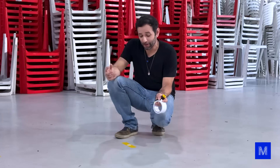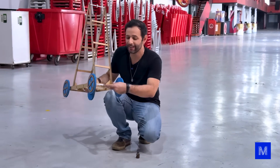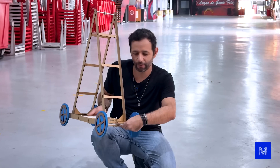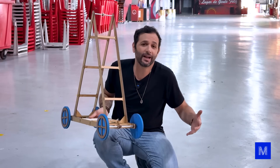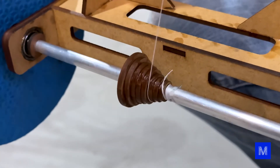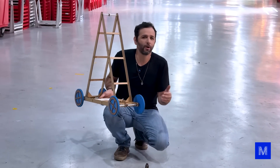Let's add more distance markers. Each wide square represents 10 meters, and at 30 meters there are three squares to avoid confusion. Now that it worked, I need to tell you the secret. Back where the line winds up, I built it like a ratchet — like a bicycle cassette. I added several pulleys of different sizes so that while winding, I can control when the cart shifts gears. If I use the aluminum gear, it's the heaviest and fastest, but it can't start in the highest gear right away. So I let the bigger pulleys wind up last — like starting a bike ride in a very light gear. As the cart gains speed, the wire lowers and unwinds over a smaller ratchet section, giving it much more speed. My challenge now is to fine-tune when it shifts gears.